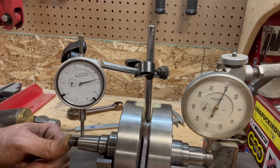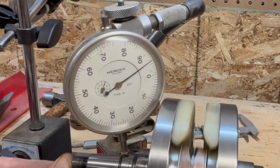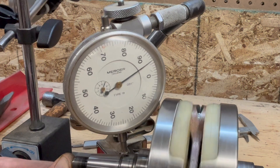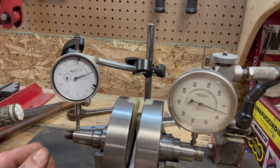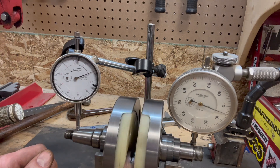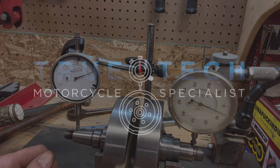To adjust the swing, I hit the crank with my hammer. If it's not parallel, I either spread it with a chisel or I clamp it in the vise to bring it closer together. You can see that we're indicating at about half a thou run out near the flat surface. Eventually they all end up like this one — it doesn't always go smoothly, and sometimes it feels like you're going backwards and you've got to take a step away for a minute. It always helps to remember that there's only two ways it can go wrong: it's either the swing, or it's parallel. I hope that helps clarify things. If you found this video helpful, I'd appreciate a thumbs up. Subscribe and hit the notification bell, and if you want to see what I'm doing on a more day-to-day basis, you can find that content on Instagram. Thanks a lot for watching.